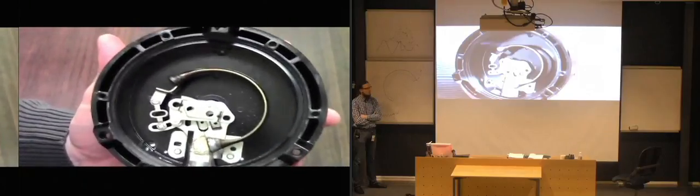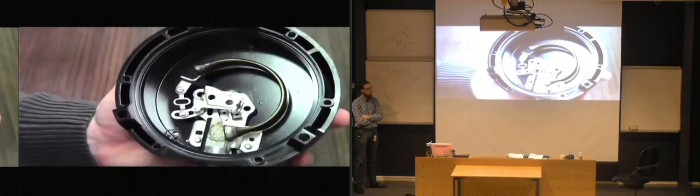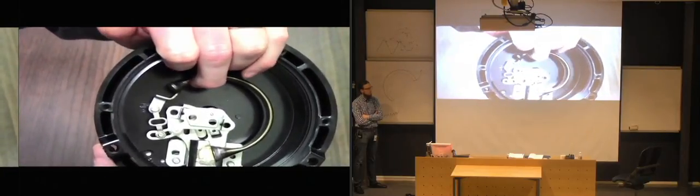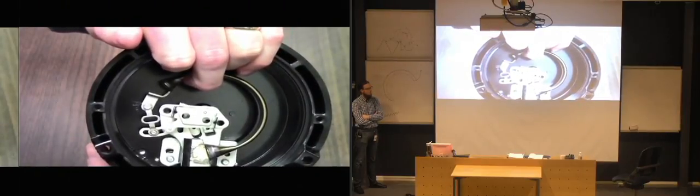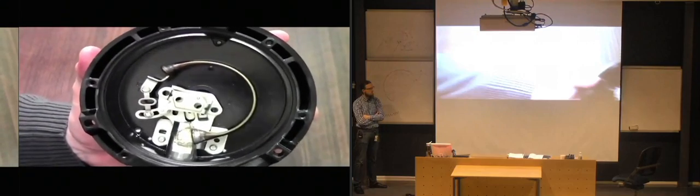The other thing is pulsations. Pulsations are anything really, a fast pressure exceeding the range of the gauge. So for instance, this is a 60 psi gauge, and if we had an application where all of a sudden you open up a valve and 300 psi hits the gauge, it's going to exceed what the Bourdon tube is made for, and it's going to try to straighten it out. And if you exceed that, the Bourdon tube may not go back to its original C shape as far as it was before. So you'll often see a gauge stuck here when there's really 0 psi in the line. These are all things that can be prevented with, as I mentioned before, liquid filling, pulsation dampening, snubbers, things like that.